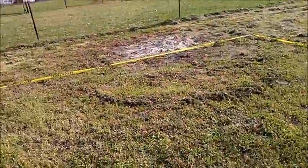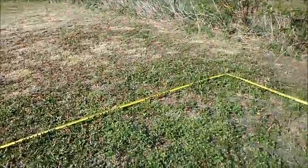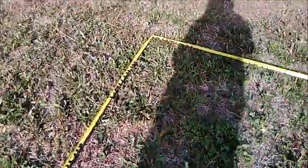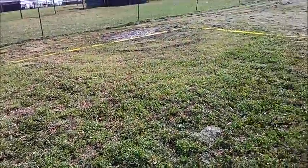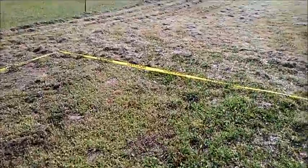The corner ones are just done — it's 20 foot across here, 20 foot across here, 20 foot across here. I know that is exactly the corner that I want. The only thing that could shift is if I haven't squared it — my measuring tape isn't long enough to do the diagonal square check. I'll go find a longer one: corner to corner diagonally has to match the opposite diagonal, and then I'm square. If I'm not square it won't be a true 20 by 20.